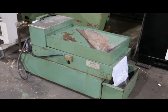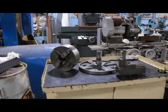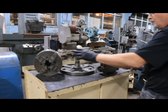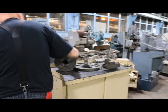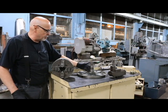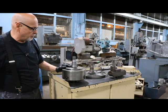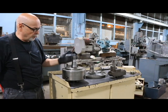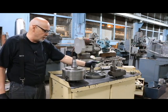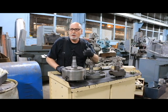There's also the coolant tank that goes with it. That's a paper band system - it has a roll of paper in there that filters the coolant and it advances itself automatically to clean paper. Dirty material goes in the garbage pail on the floor. We've also got a cabinet here with some accessories: an eight-inch four-jaw chuck, a Jones and Shipman special adapter that goes in the spindle - anything that goes in that spindle needs to have this taper - a 14-inch slotted face plate that comes with the grinder, and a table-mounted diamond that you can use to dress the grinding wheel.